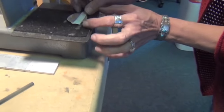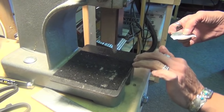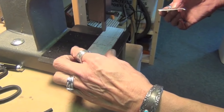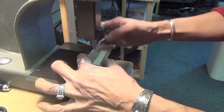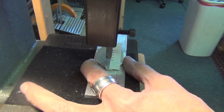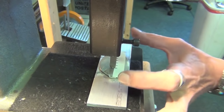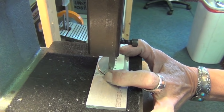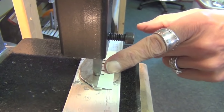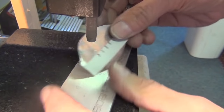I've gone ahead and put the P in. Now I have some Velcro on my base plate and it's not going to give me a firm enough surface to press up against, so I've got this little piece of aluminum that's going to allow me to have a firm surface. If you're also using your Arbor Press for bending and you have Velcro there that's interfering, you might want to put a strip of metal or something firm up against there. You want to line up the mark with the center of the stamp and give it a firm press. And then you have your first letter, P.